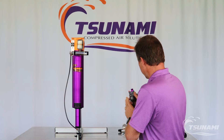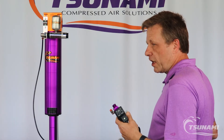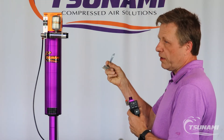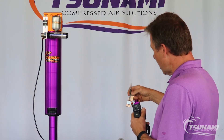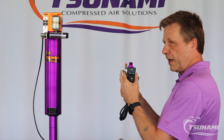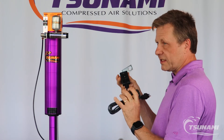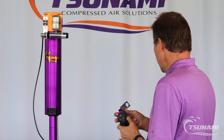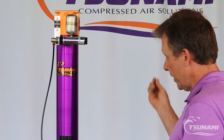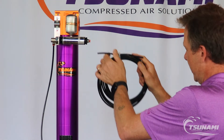We're going to utilize this within 20 to 25 feet — you can go longer, but the kit itself comes with 25 feet of pilot tubing. It comes with a mounting bracket so you can mount it to a wall, or with the use of our U-bolt directly to some air piping out in your shop, but you are going to want to mount it within six feet of a power source. Once the drain is mounted, you run the air tubing and the kit comes with fittings to attach a pilot signal to it.